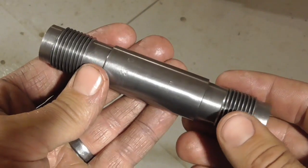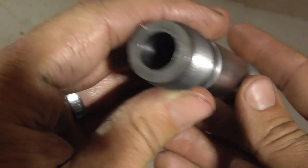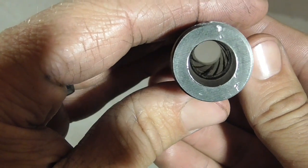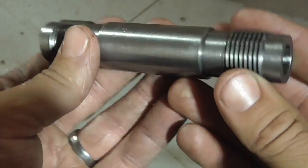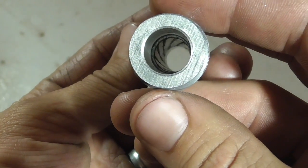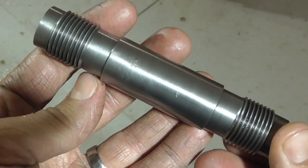That's going to be necessary for fully testing the monoclinic rifling concept because the rifling will likely behave differently depending on which way the bullet goes through it. If we fire a round through it this way, it should engage the hard edge of the rifling, and the rifling should spin the bullet just like spline rifling would. Whereas if we shoot it through this way, the bullet will be engaging the gentle edge on the rifling, and so it should behave more like polygonal rifling in this direction. At this point, I think we're ready to take it out and test it.